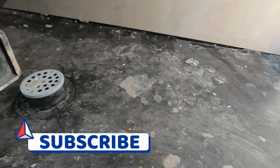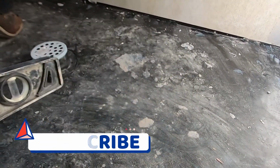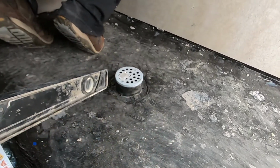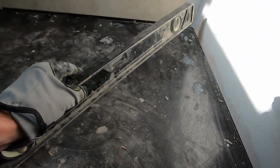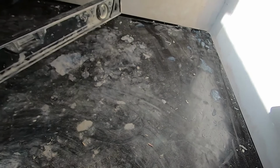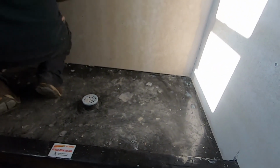And then we're gonna put in our wire mesh, some pea gravel around the drain to protect the weep holes. And then we'll be floating our cement. What I use is a stucco mix, and we'll be floating that out with our pitch then. And I'm gonna snap the lines.